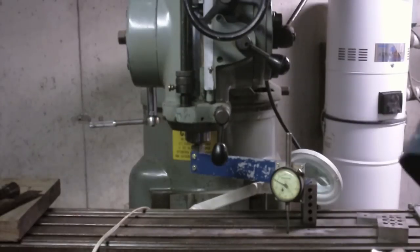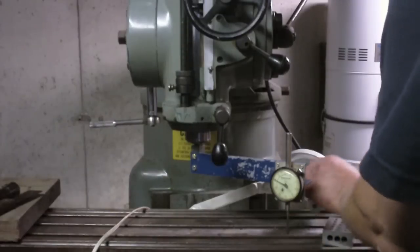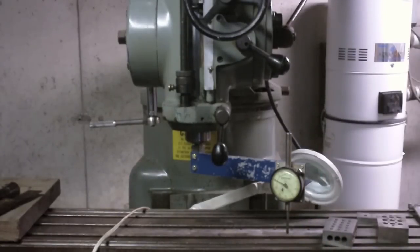and the reason for that is because oftentimes somebody makes a homemade pair of blocks with the intention of having them precision ground and never gets around to having that step done, because a lot of guys have the equipment to make a block but don't have a surface grinder, so they send them out, and if they never get around to it, well, but that one there is right on, as is that one within maybe 1/4 of a thousand.